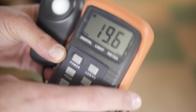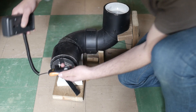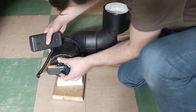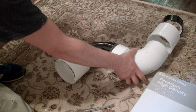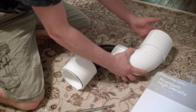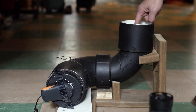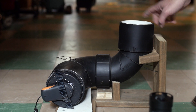So you make the device. The idea behind the device is that it's white and curved on the inside. The light meter sensor is placed somewhere to measure the ambient light inside of the device, but without being in direct contact with the beam. Some people use styrofoam balls, some use milk cartons, and other miscellaneous parts. But my method uses 4-inch PVC pipe with two bends in it - on one end you shine the light, and the other end you put your light meter sensor. And it also looks like a pipe bomb.